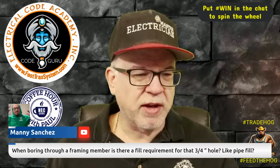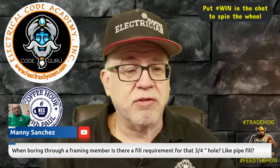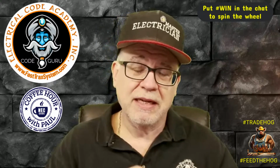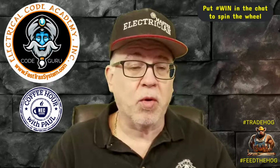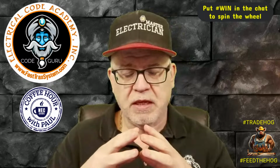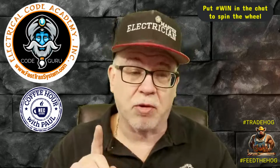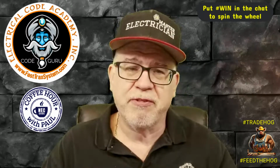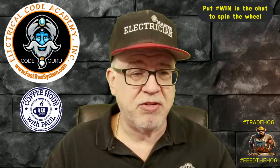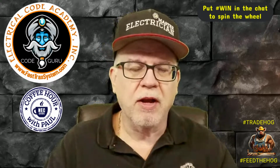When boring through framing members, is there a fill requirement for a 3/4 hole like pipe fill? No, there isn't. I do get that question a lot, Manny. A lot of people will ask, how many NM cables can I stick through a bored hole? And the reality is, if it's a bored hole that's not going to have insulation in it, then it's not going to really affect anything. But if we're just talking fill, you can put as many cables through the bored hole as can fit without damaging the cable. If you're putting it through there and it causes the sheathing to rip or damage, then that's a problem. But there is no fill. It's not a raceway, so there is no fill requirement.